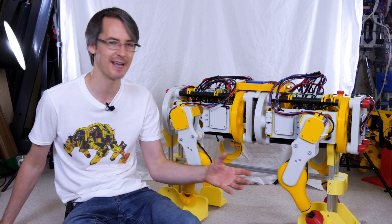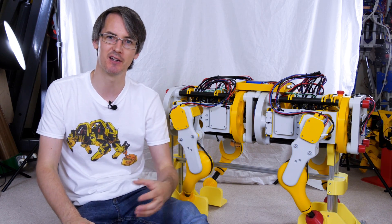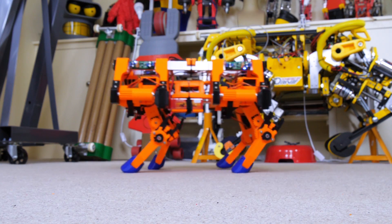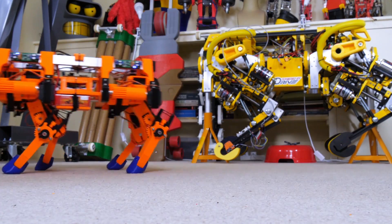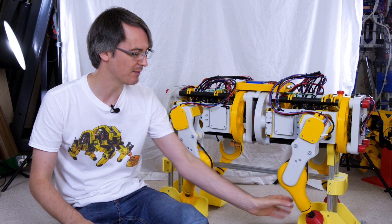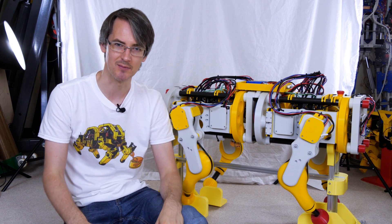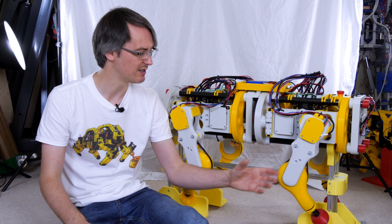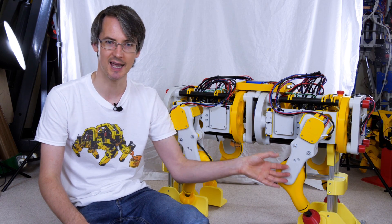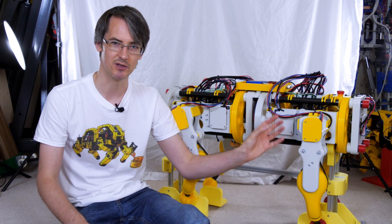That was a test of how fast the legs will move and whether they can pick themselves up and put themselves down completely clearing the ground before it has a chance to tip over — a luxury I didn't have with the previous dogs, which used geared-down servos and moved quite slowly, so they really had to stay stable on two legs. At the moment there's no stability control; it's just picking feet up and putting them down really quickly before it has a chance to tip over. They were coming up to bolt-straight legs, which means no cushioning on compliance between steps, so having more bent legs might be better — but we'll probably need stability control for that. Also, one leg wasn't quite at its zero point when straight because I still haven't sorted automatic zeroing; I set them up by eye before powering up the O-drives.